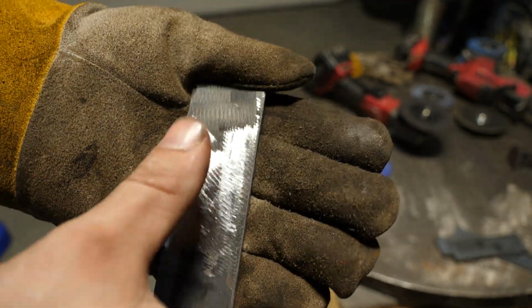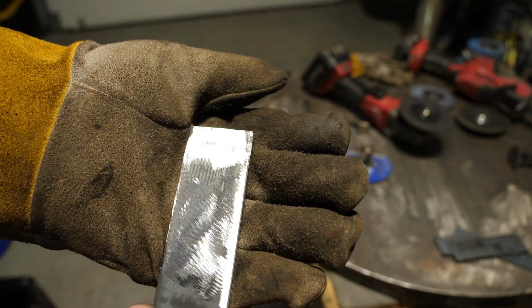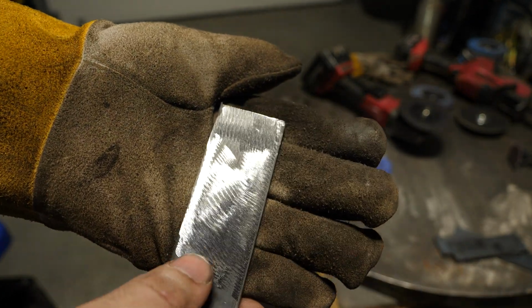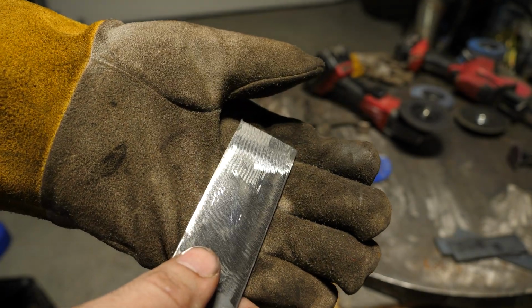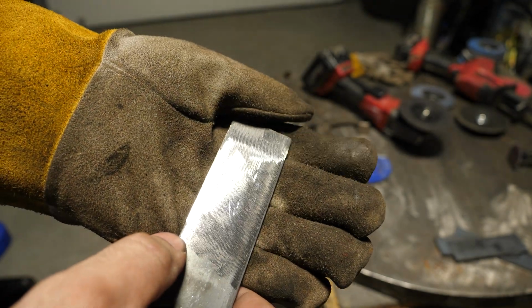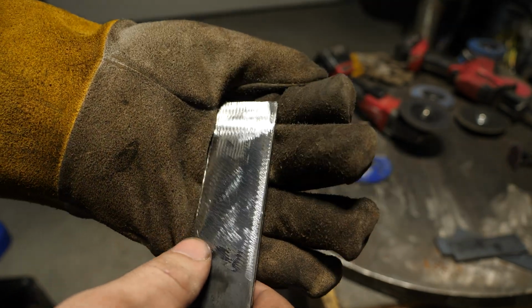The surface finish, just feeling it, is better than a hard rock. There's no doubt this is closer to a flap disc, not quite. So better surface finish, equally as fast, I would say, if not faster than the hard rock. I noticed that wheels like that tend not to jump around as much. The hard rocks tend to bounce a lot worse, so these tend to be smoother.